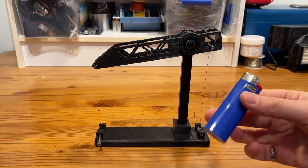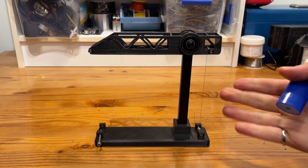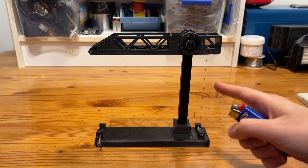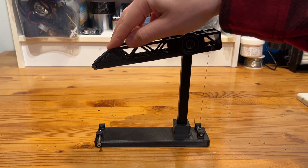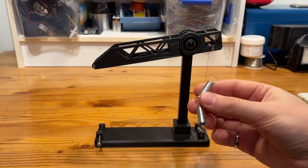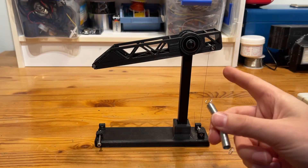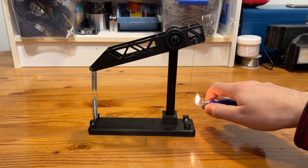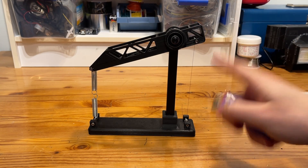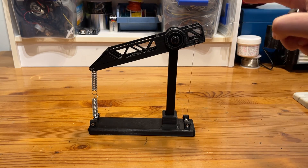Our test stand's good to go, so now what we need is a source of heat that we can use to heat the wire, and we can see the crane moves up. What you'll notice is it's not returning back to its original state, and that's because once you heat the wire up and it contracts, you need to apply a restoring force in order to return the wire to its original length. What we're going to do to simplify testing is add springs connected on the load portion of this crane assembly in order to return it to its length after the wire is no longer heated.